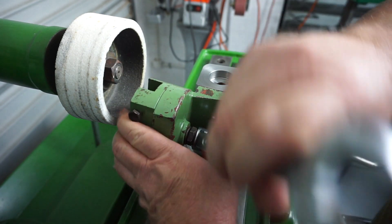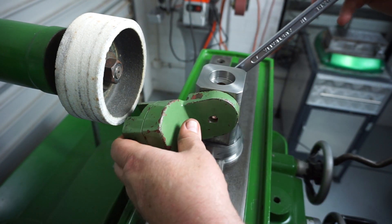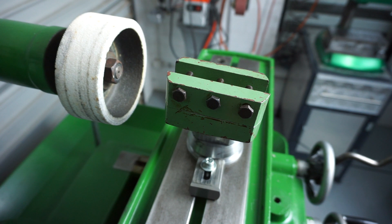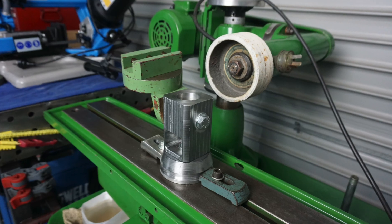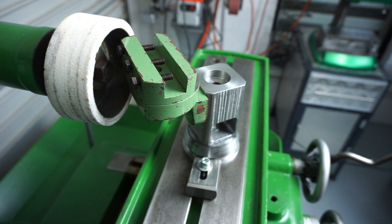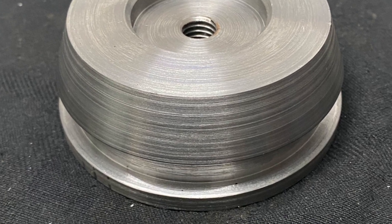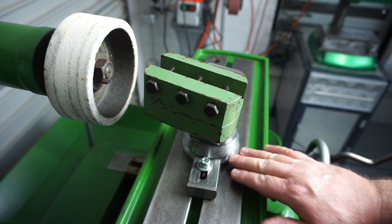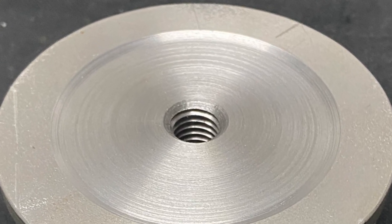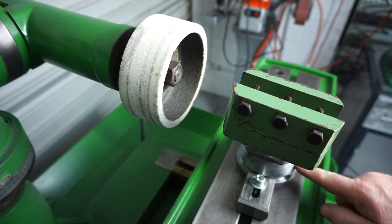I can rotate it around this plane here and lock that up vertically. I've scalloped out a pocket here — you can see the large pocket I've milled out — and that allows me to rotate it on the platform as well. I grooved out the bottom and I've got to make some new toe clamps, a bit more lower profile. The base is also dished out on the bottom and works on the magnetic table, which was an added bonus. Let's jump into the build video — first the making of the posts, then the base.